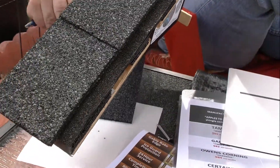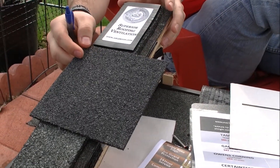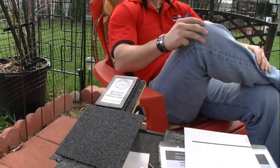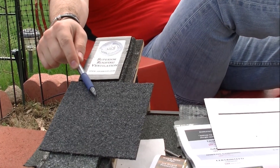And of course, my Thunderguard shingle, which is a rubberized SBS shingle that actually has the granules vulcanized into the surface instead of sprayed on. And what's the importance of that? Helps granule retention. If you can keep the granules on a shingle forever, your shingle would last forever. On a fiberglass asphalt shingle, the granules are typically sprayed onto it, which over time and weather can lose a lot of its granules, causing you to lose your UV ray protection. By vulcanizing them — meaning they're actually pressed into the rubber matting — our granule retention is just unbelievable.